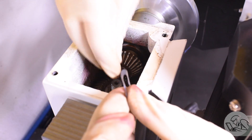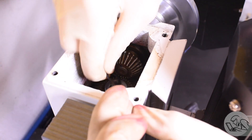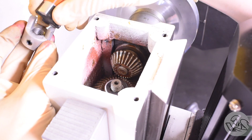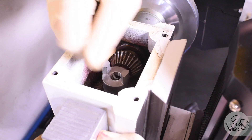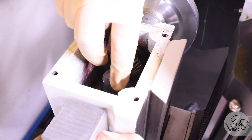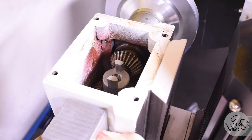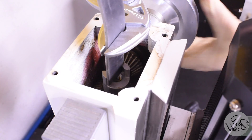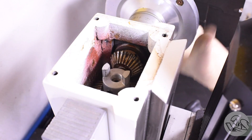I'll clean out some of the old grease. There's one factory washer down there and the kit comes with two extras and a wave washer to lock things together. You put those down on top and then the spider shaft coupler separates — you put the lower part down in place of the M12 nut that was on there. The wave washer will lock it in place since it's not nylock like the nut was. There's also a set screw but I'm not going to tighten that because it would just jack up the threads on my lead screw for no good reason. To tighten it down I used a scrap of bar stock and some pliers to snug it all the way — it's easy to tell when it's tight and the wave washer will lock it so it won't loosen. Everything turns.